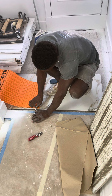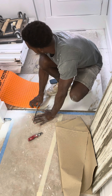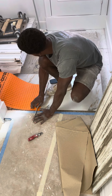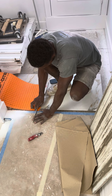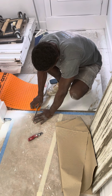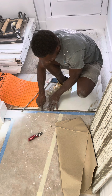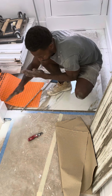I almost need to put some Schluter on top — I could have just self-leveled the whole thing. Or Schluter on top of the Durock, and then I need some three eighths Durock with Schluter on top, and that'll get me the thin set and get me even. Because I don't want any transition — I have to cut the lip off with this tongue and groove hardwood. No transition wood to tile, smooth.